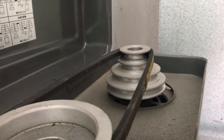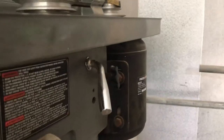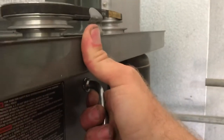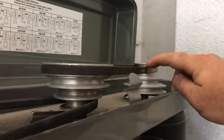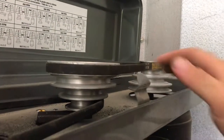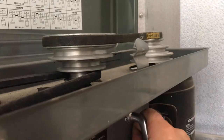Finally I noticed that around the motor, this hole is extra big. The motor is just on slides right here — you can see these little shiny slides. There's a set screw here and a set screw here, and these have probably just worked their way loose. There's just this handle, and if you pull it toward you that's about as far in as it goes, but that's enough that the belts are workable and you can slip them off. To tighten it, you just push the handle away and crank it back, then tighten down those set screws.